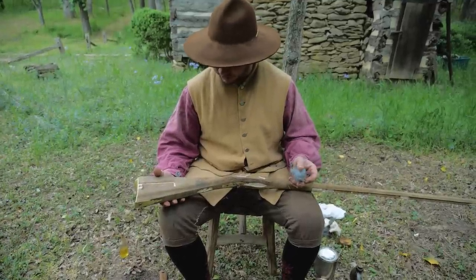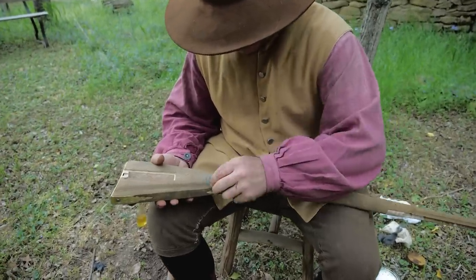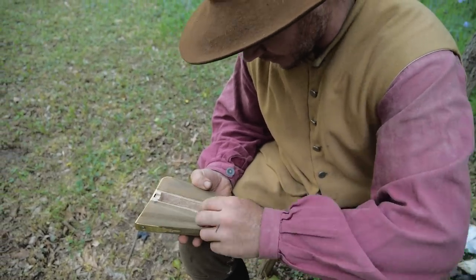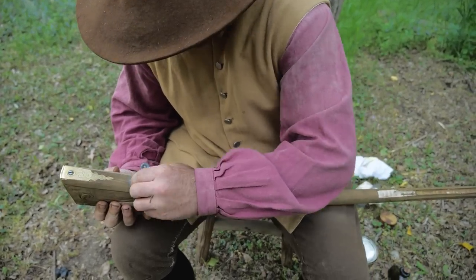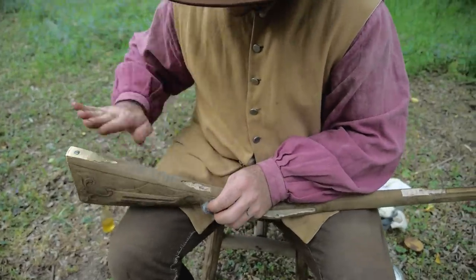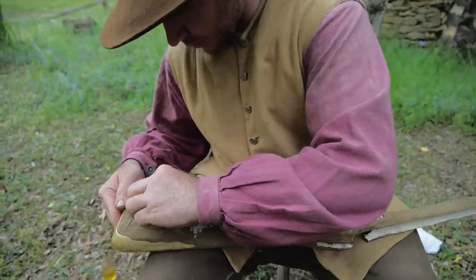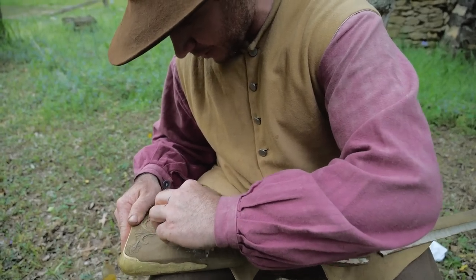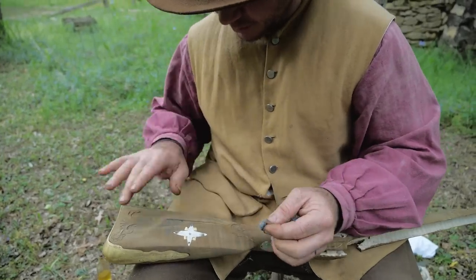We've got the color brought out now. I'm just going to take some steel wool and lightly rub it — any burnt spots where you got a little too hot can be taken out. I'm not applying a lot of pressure at all. What this does is address the grain that wants to raise up a little from the heat, and it also thins the stain out just slightly to give you a richer color. You can actually rub a little harder on your carvings — that'll take a little more stain off the carving and make it a little bit lighter than the rest of the stock, which adds a neat aged effect.